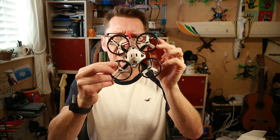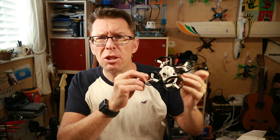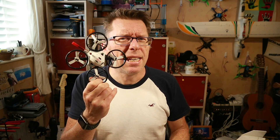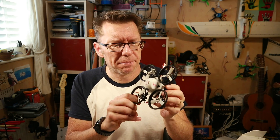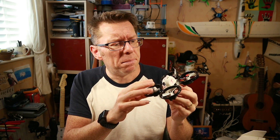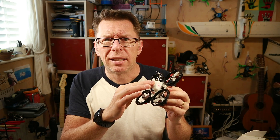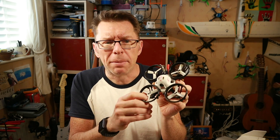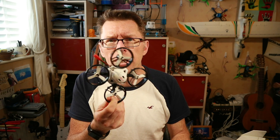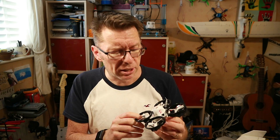Remember the little King Kong ET100? It's a really nice 100mm quad which I thought was going to be too big to fly indoors, but it did really well and is reasonably good outdoors — it's got the power. One weird thing is that the ESCs, because it's brushless, supported DSHOT, but the flight controller kind of tried to support DSHOT but couldn't. If you said DSHOT 600, three of the motors would spin up and one wouldn't — not very usable in a quad.